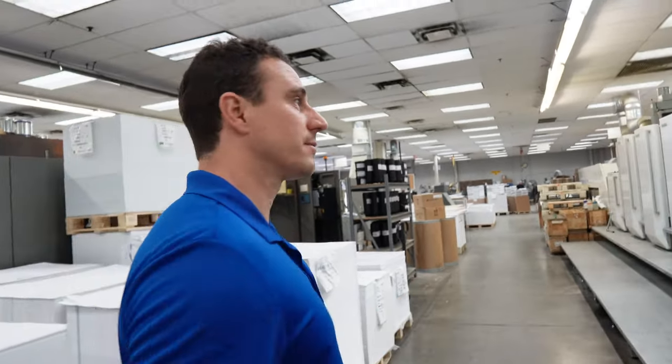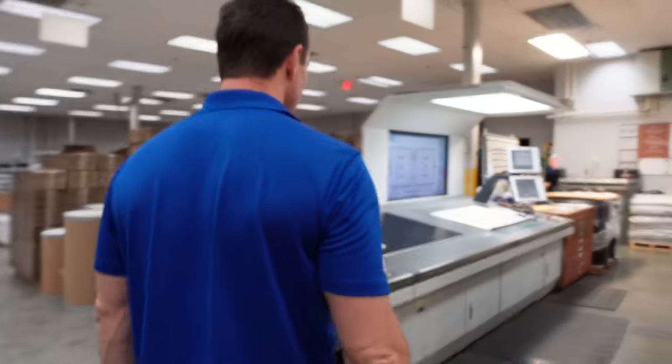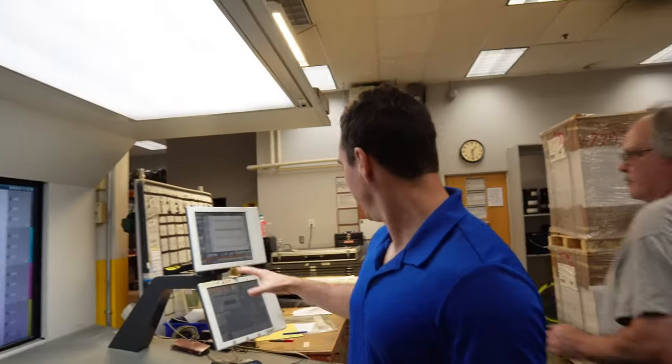This whole thing right here is our printer. It'll go all the way down — this is probably 15 to 20 yards long — and we'll show you where they proof it on the other side. Right here we've got some printed copies coming off the press. I've already proofed them. We adjusted the color a little bit, pulled a little yellow out. I approved them and now they're going to press. Right here is where the bulk of the color work is done. Once we approve them, we have a color profile set. They'll continue to check for color as we go through the press run. This is done with a scanner here and digitally. If we need to adjust color, they'll adjust the color one at a time — cyan, magenta, yellow, or black — and it's all done digitally.